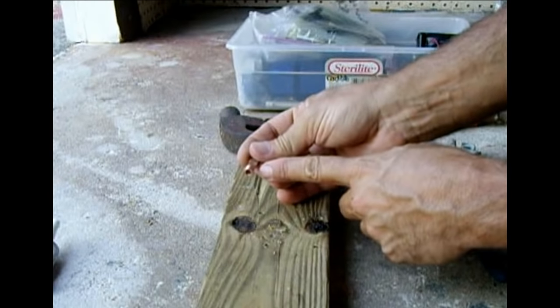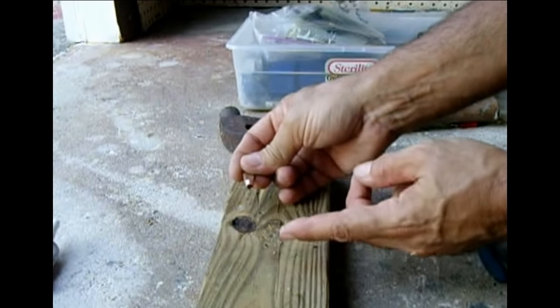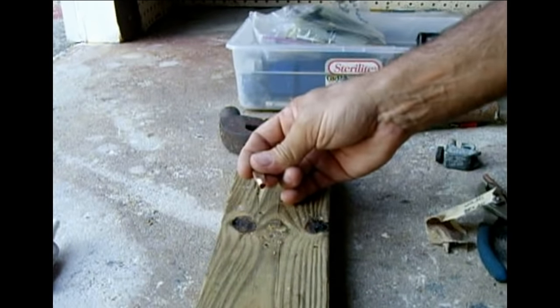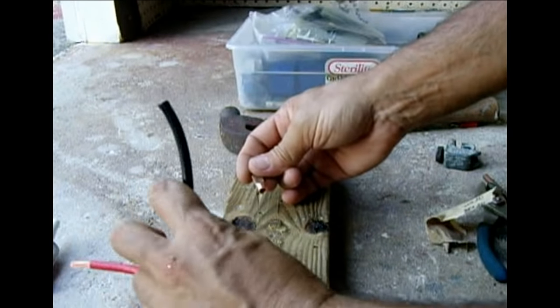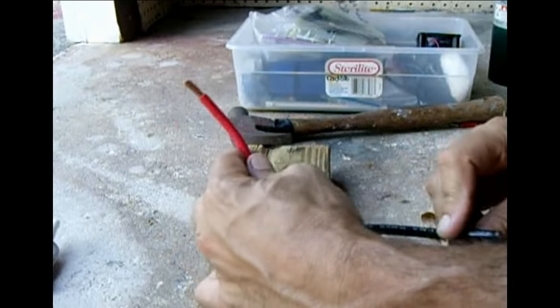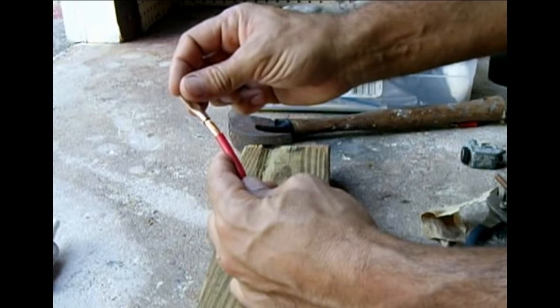I have a special crimper — I could slide this on the cable right now with a piece of heat shrink, hit it with the crimper, slide the heat shrink over and be done. But the best way to do it is to take a cable like this, strip it back about three quarters of an inch, and slide the connector over and then solder it.